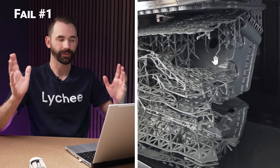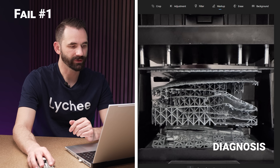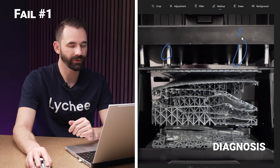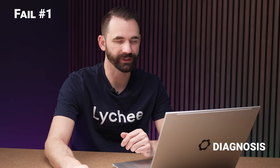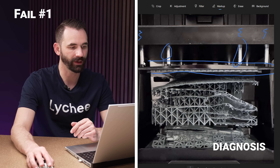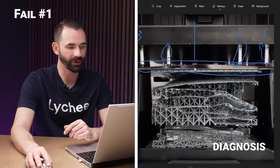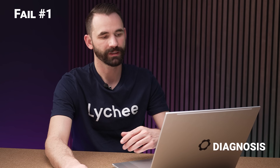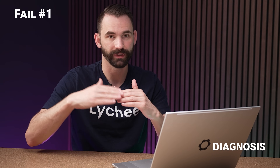That thickness is the key to this whole thing. Let me explain what's going on. This printer has something very unique about it — behind these posts, there are coil springs on the outside ones. Those coil springs are always working; nothing locks them in place once the print starts. What happens is the entire bottom build plate can actually move up into the chassis as the entire system moves down into the resin. As the build plate pushes down into the resin, which is very thick and viscous, it creates pressure and pushes back up.